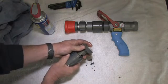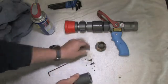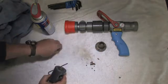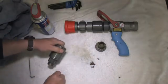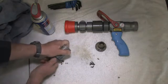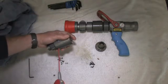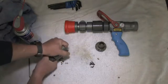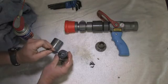Now you should be able to gently slide out the metering selector. Note that we're going to be dealing with two different sizes of bearings: two larger set-point bearings and a lot of smaller retainer bearings. Next, we'll remove the one-way check valve by taking out the set screw and then all the ball bearings. If you have difficulty getting all the bearings out, keep working with it and use a little WD-40. As those last few bearings come out, you should be able to remove the one-way check valve.